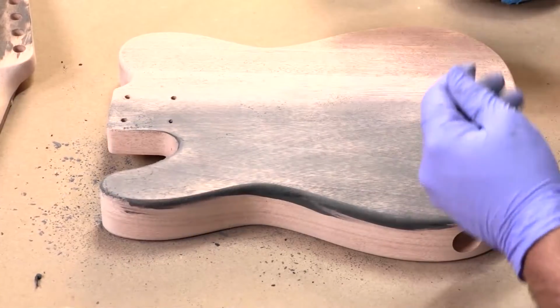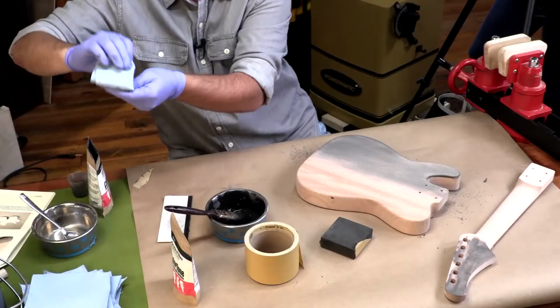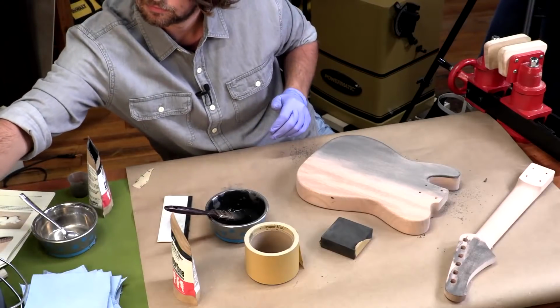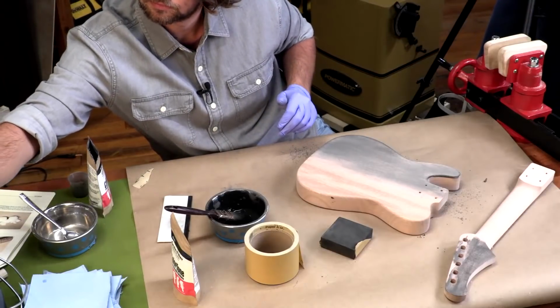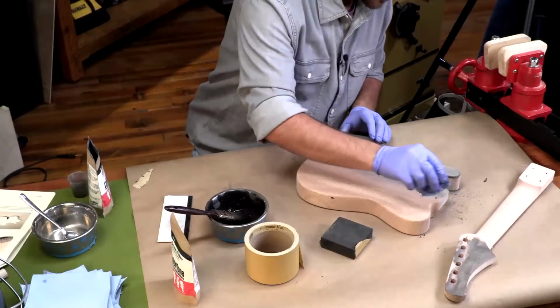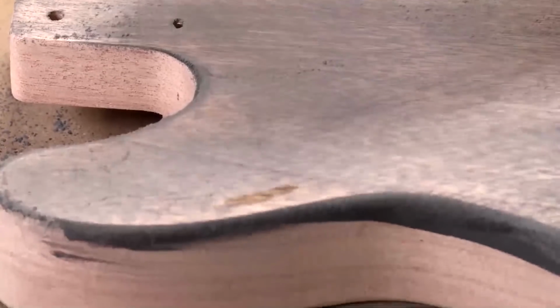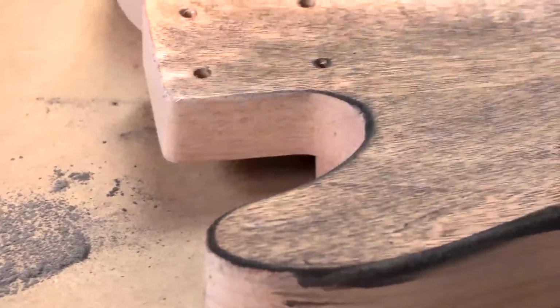And let's see, what else did I miss? Another one. And actually, Eddie, absolutely. So that's how we would normally recommend doing it: spreading on the grain filler and letting it dry for about an hour till it gets nice and chalky. That's exactly right. So you can start to see where it's coming through, and that's what we're going for. I'm just going to take a damp rag again, wipe some of this dust off, and you can already see where we're going.